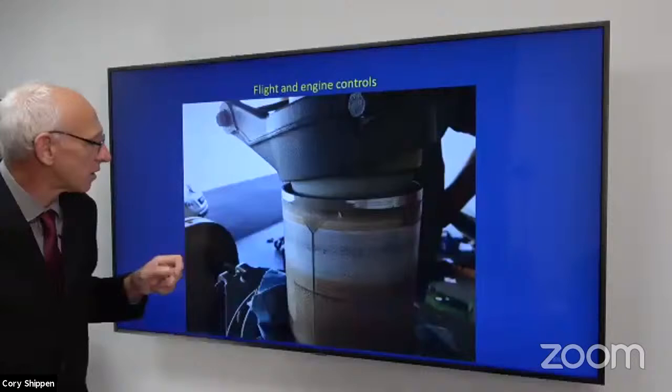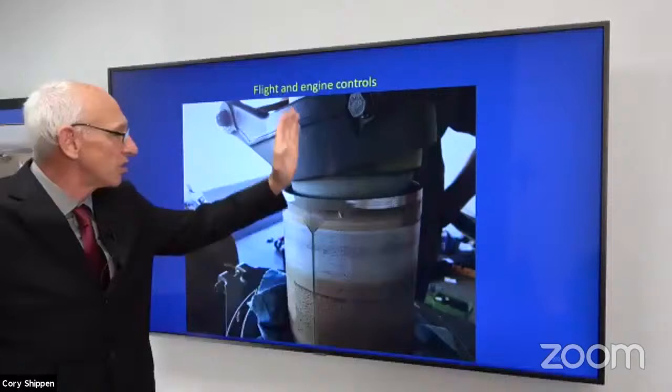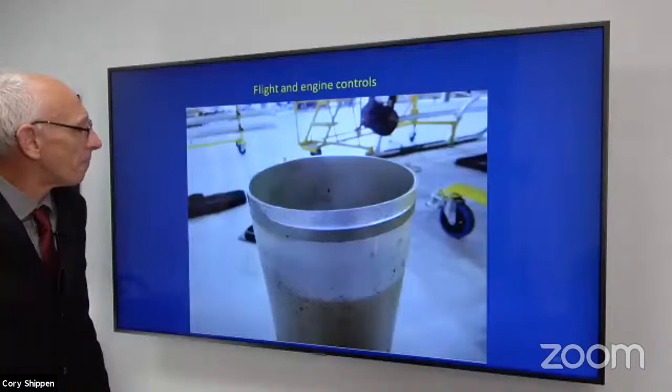Okay, here we have the drive collar on a dual hydraulic aircraft. Our manual will tell you to check your perpendicularity. That means this thing needs to be straight so you have an even gap all the way around. Clearly, this didn't happen. It's cocked, and so it was making contact as it went. Here's a close up of that.